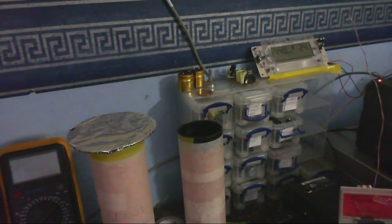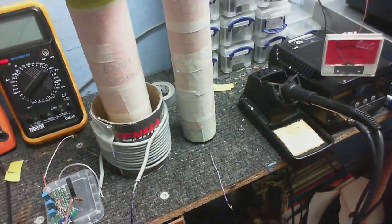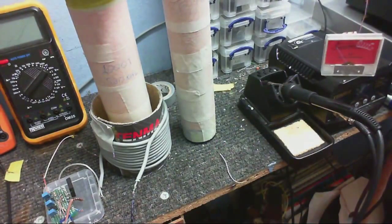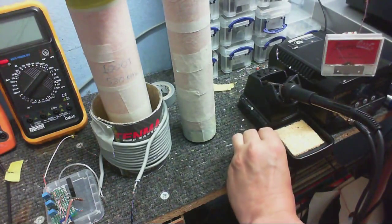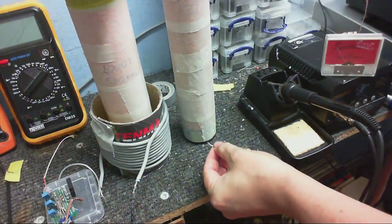Well, I cannot do that for too long because it just starts making the wire melt. Now, a weird thing is, though, if I disconnect the ground, and this is something I did when I first tried this, but I didn't realize that I had this wire sort of like that on my soldering iron. It arced through the insulation to my soldering station. You can see that right there, that it just burnt through the wire.